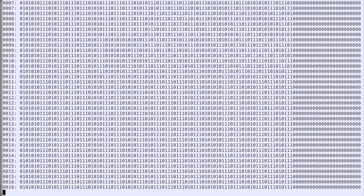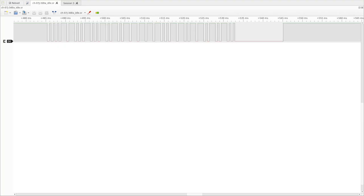Drawing on past experience and imagining what the designer had in mind — there is a pattern. The bitstream only includes groups of '01' and '0111'. In the trace it's either a short low pulse followed by a short high pulse, or a short low pulse followed by a long high pulse. The last low pulse is a break condition signaling end of transmission. This is very similar to infrared protocols using pulse width modulation.